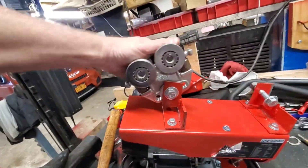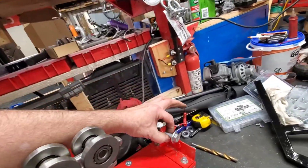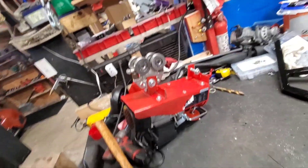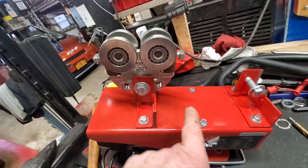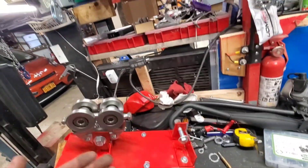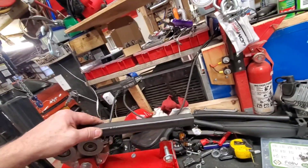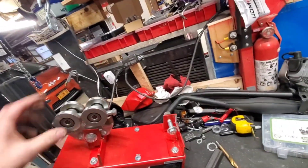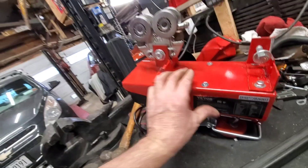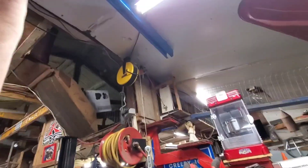Here's what I was talking about — the trolley wheels are here, and the other one will be mounted on this side for a straight line. What I didn't think of — and I admit my mistakes — I didn't center these. I welded one off over here and one off over there, so they're a bit offset. But that's fine: this will go on the outside one and this on the inside one, and that'll straighten everything right up. Oh, it fits in there nice!